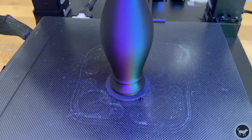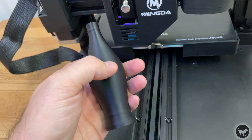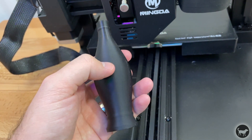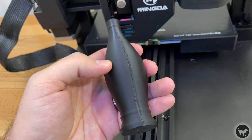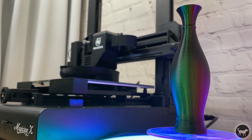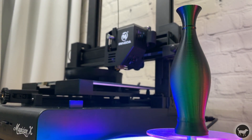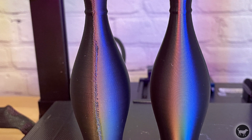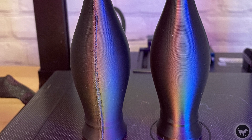The next thing I printed was the vase which was also on the card. It printed very nicely on the front but I noticed on the back that the z-seam was very noticeable on the surface of the vase. I reached out to Mingda and asked if I could have the vase STL file, which they also sent out right away. I figured since this was a vase I would use the spiralize outer contour option in Cura — otherwise known as vase mode — and the printer printed that file flawlessly. The original file also seemed to be missing the top of the vase for some reason. I also sent this g-code file back to Mingda, but again if they don't post it I will in the description.